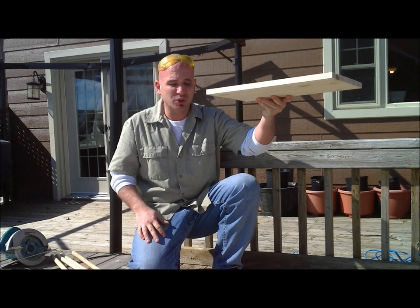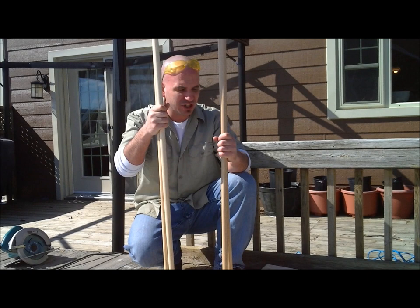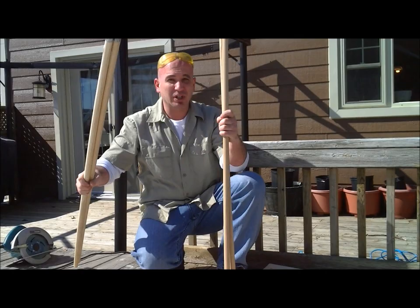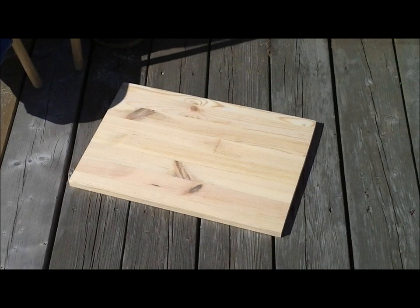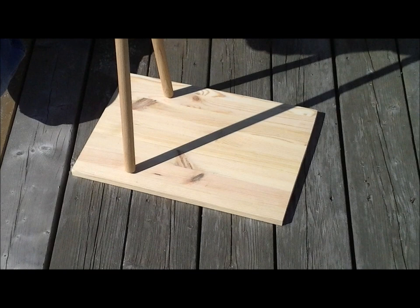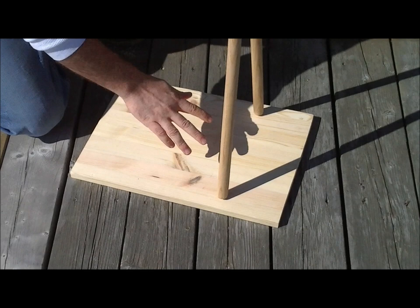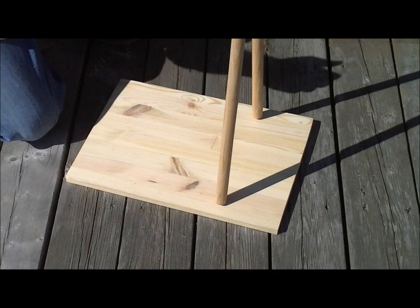Next, we've got our four broom handles from the hardware store at $2.50 each. They're hardwood so they'll hold up and stay rigid because the grain of the wood is much tighter. Here's how all the pieces come together: we have our square base at the bottom and we bring in our dowels — two on each side, sandwiching the bottles in between, but leaving some space at the edge so it doesn't become tippy and unstable. The other two dowels go just far enough apart to store two bottles on the inside, always keeping an extra ledge at the side so the weight doesn't tip it.